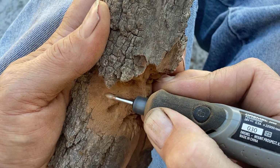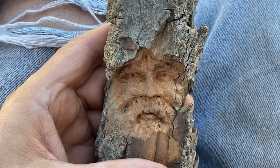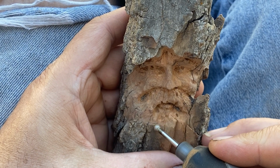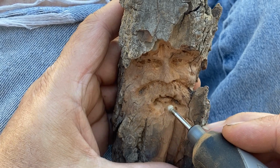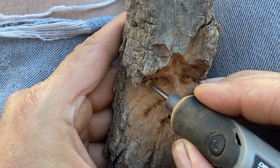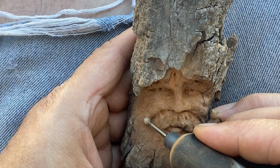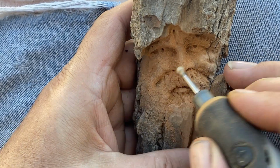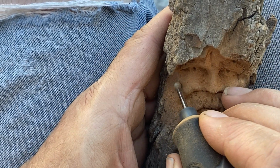But yeah, and you just clean these things off. They get gummy after a while, especially with pine knots. They're more difficult to use. But when you want to clean these, just soak them in some kind of acetone or solvent, like rubbing alcohol is a good one. It's usually a household item that's readily available. Soak them for a few minutes and then just put them back on the Dremel and then rotate them on a small wire brush. That's a welder's brush. Because the brass brush is less aggressive on your metal bits because it's a soft metal and doesn't scratch your burrs as much.